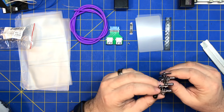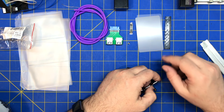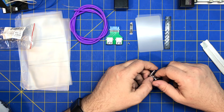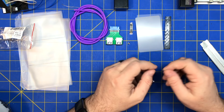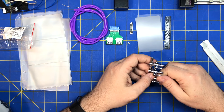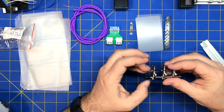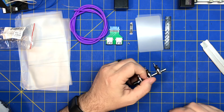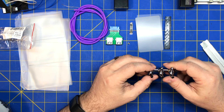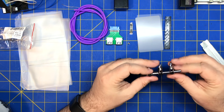When you're working with components and you have to switch from a 0603 size to something bigger, usually you need a different tip — it's not going to pick up right. I always have to find the rubber tips for bigger packages. So if I could just have three air tools hooked up that I can grab with different tips, it's going to be a lot faster to assemble. Normally you'd put all one size on, then change it, but if you're doing one board at a time or small quantities, it becomes a problem constantly switching.